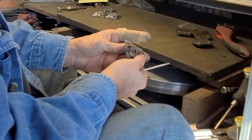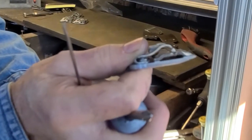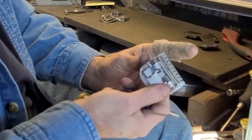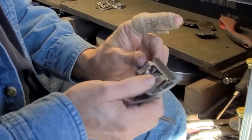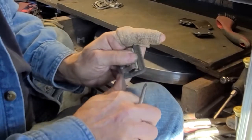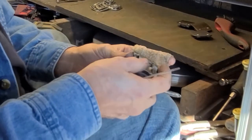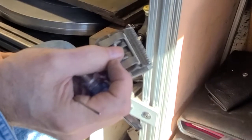Don't you find when you do that, though, a good amount of the time they're not nice on the front? See how nice it is on the front? Yeah, but aren't there some times it's not nice like that on the front? Occasionally, but that's why as I'm looking, like this one, it's right at the edge, and I would not leave it like that. So I will move it back a little bit. And it's especially important on the number 40 blades that you sight down and make sure you've got a setback that's at least that much, which is about a 20,000th.